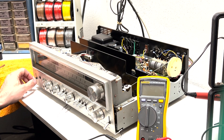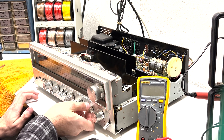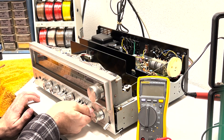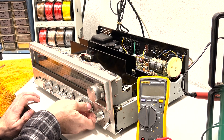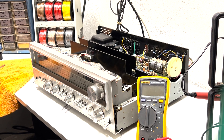All the switches are clean. I already felt a difference in the balance knob — before it felt really gritty and just didn't feel right, now it's nice and smooth just like it should be. I feel like that's probably a big contributor to the left channel signal being distorted. Now it is time to check the DC offset.